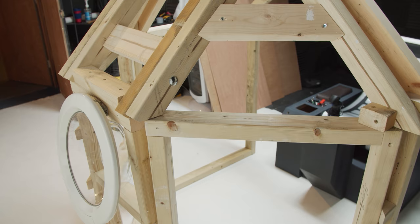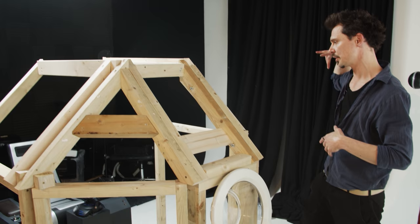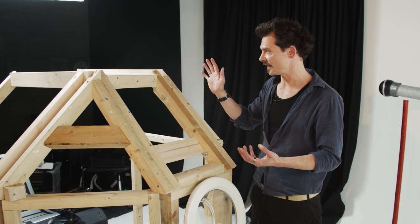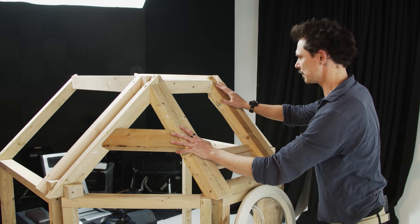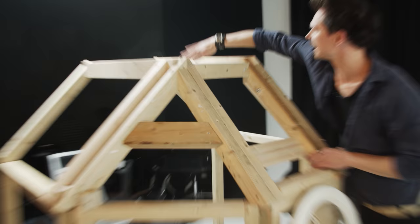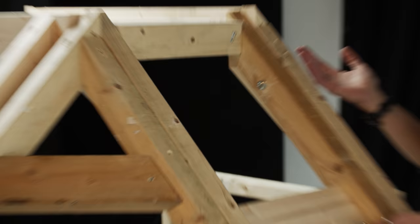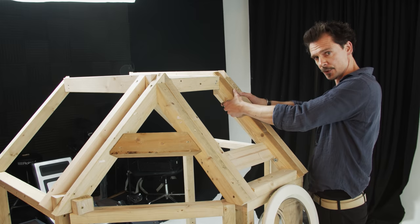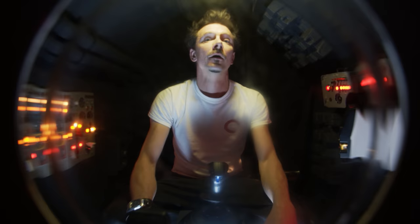Porthole. As you can see, I've made it in two pieces. My thinking is I want to shoot pretty much all three-quarter shots and profile shots from this side. The most complicated part of the build has been making it actually removable. The front and right section is one piece and then this left section is another piece. I've bolted them together with big M10 100mm bolts, washers and nuts - four of those running along here rather than screws, which would eventually screw up the wood. Gone for bolts so we just unscrew them and pull it apart. Nice and easy for while we're shooting.